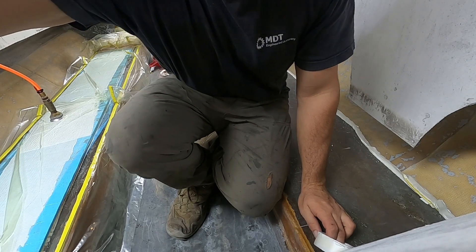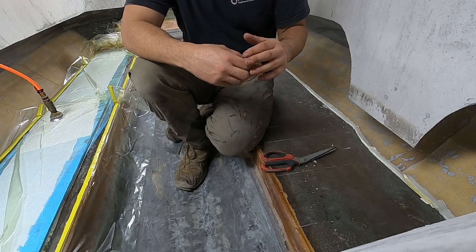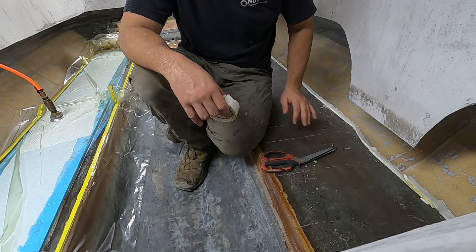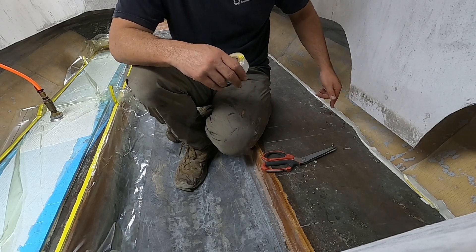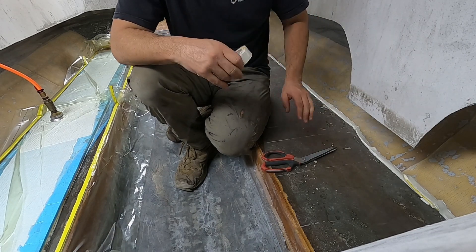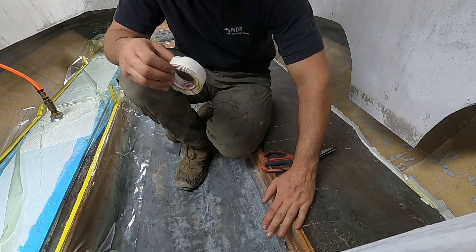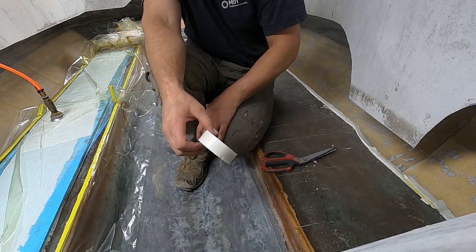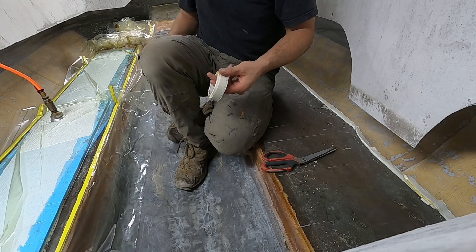After a couple of issues with the first bag I changed the way I'm doing my pleats and corners. Often you see guys overlap their corners and build pleats into straight runs as they go. Last time I did this I had issues getting them to seal at the corners and at the pleats. I watched a gentleman on YouTube — years ago now — who ran straight flat lines and then came back and added pleats after, doing butt joints instead of overlapping joints at the corners. That's what I'm doing now. I'm going to wipe this bag area down with acetone, get the bag set up, mix some epoxy, and try to get this second piece of core down.